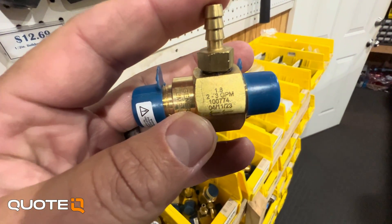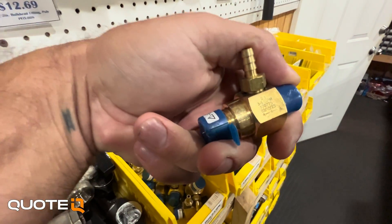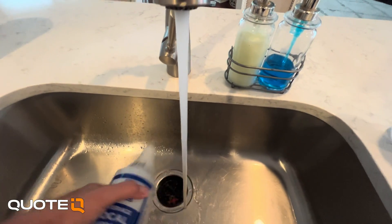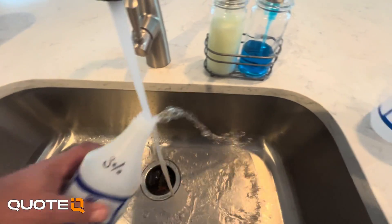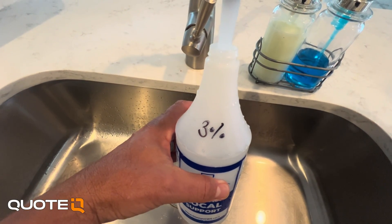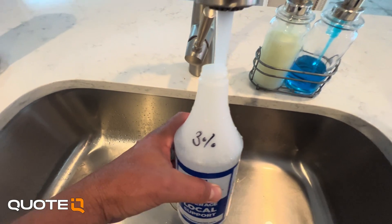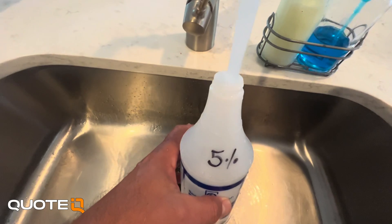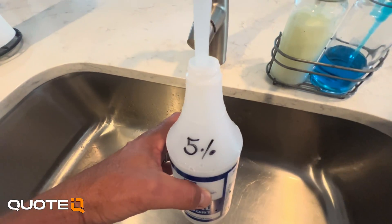With a fixed downstream injector it has a set pull rate, so you can adjust the strength of the bleach to get to different ratios, although it's somewhat limited and definitely the weakest strength application. You could also use an X-Jet where you can get a stronger application with the different proportioners that come with it, but still limited because you're using the pressure from your pressure washer to pull the chemical, which introduces a lot of water and dilutes the bleach. A dedicated soft wash pump can pull any percentage because there is no need to introduce any other source into your mix unless you choose to.